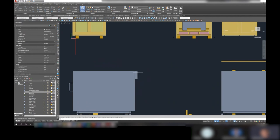Why? Because if you make your panel smaller, your clearance will have a problem, right? So the panel will be calculated from here. The panel clearance will be from this edge to the panel, 3 inches. Then the top is also the same. If you have lumber over here, I mean you use the strap-down method, the 3 inches will be from this top to here. If you don't have any strap, the clearance from the top is also 3 inches. So always remember, very fast, very easy, all 3 inches per side.